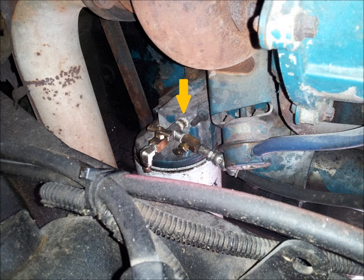Next, remove the one-quarter-inch plug on the oil filter housing and install the adapter assembly as shown. There are two valves on this assembly: the one on the side with a 90-degree street elbow and plug is for taking oil samples, and the second valve is for regulating the flow rate of the incoming oil. Using the thread sealant provided, attach the swivel end of the oil supply line assembly onto the regulating valve just installed, and secure it as required with the tie wraps provided.